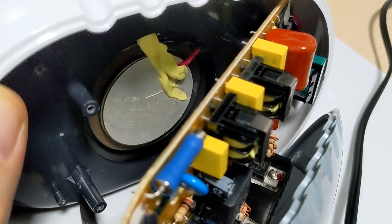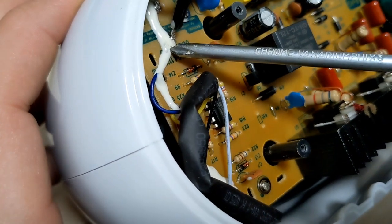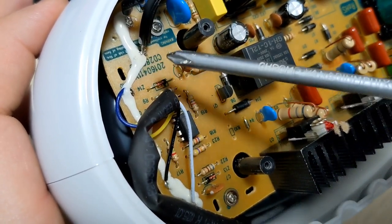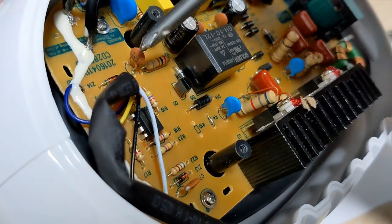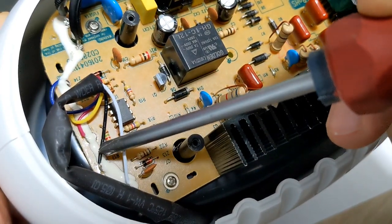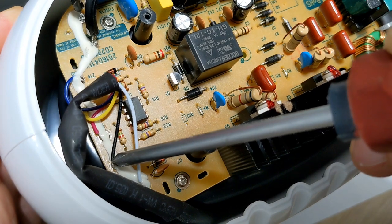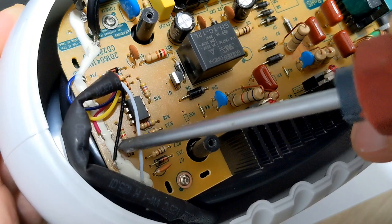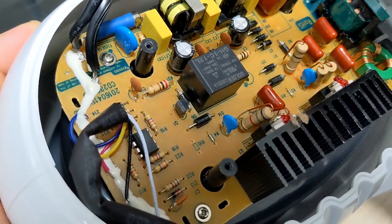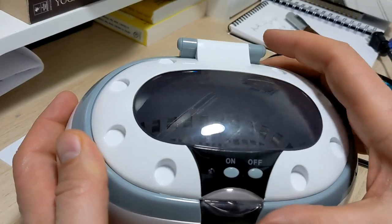A quick nitpick on cheap products like this: they use RTV - electrical-grade silicone - on components, which is good for strain relief in high-vibration environments. They should have RTV on these fly wires so vibration doesn't snap the solder joints. But they don't put it where it counts - it should go over the top of the connections, and same for the AC line coming in to give strain relief. Anyway, let's get back to pens.